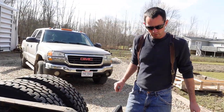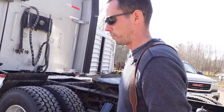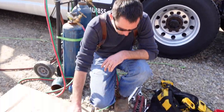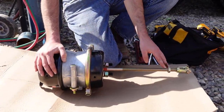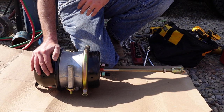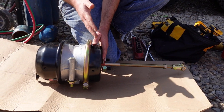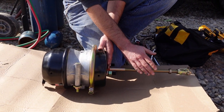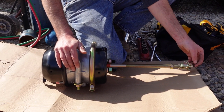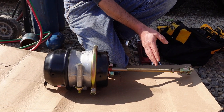I've seen a lot of videos on YouTube. When you're replacing a brake chamber, there's a couple different ways you can do it. And I see a lot of videos on the main way to do it, and that's you buy a brand new brake chamber like this, and you gotta cut this rod to length. The way I normally do it is have somebody get in and hold the brake. You take a tape measure, and when you hit the brake in there, it's gonna extend this rod, and then you can measure from the casing to the center of this clevis on the truck,